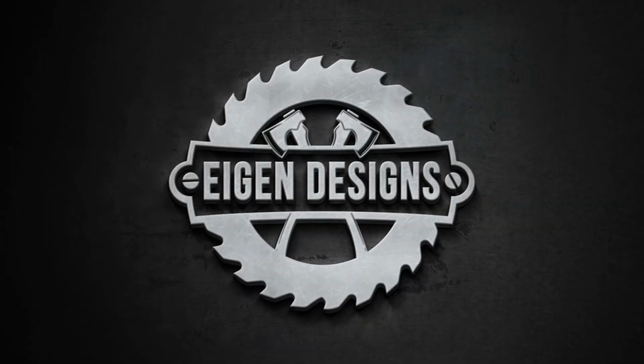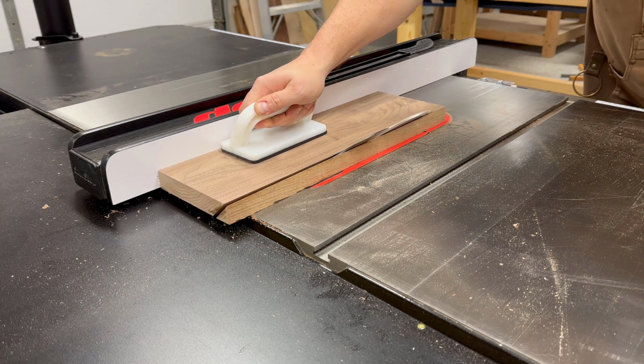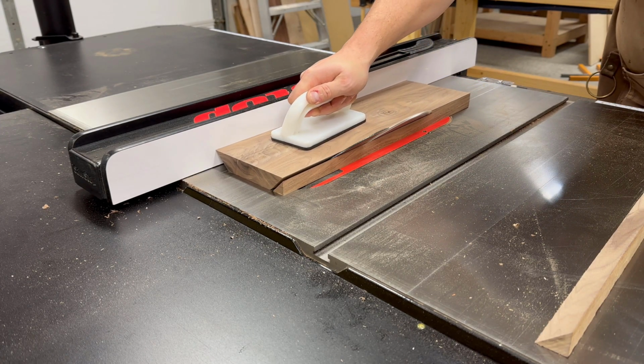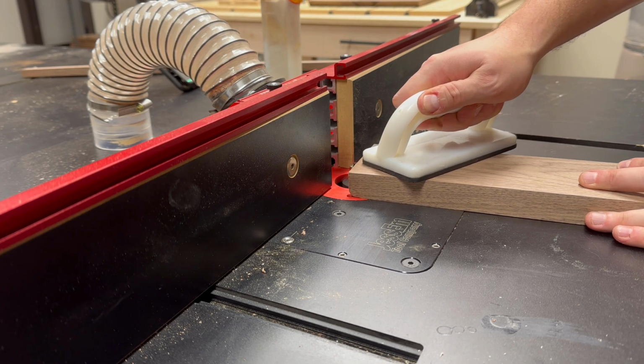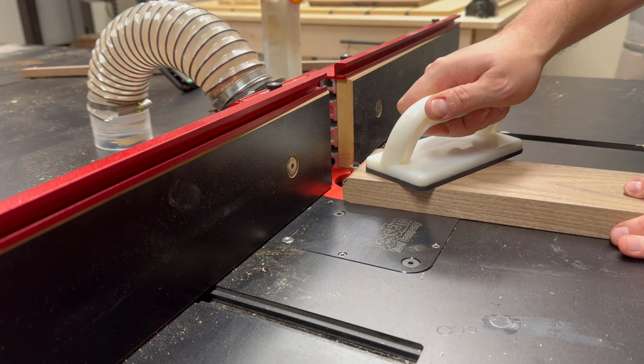While waiting for the inlays to dry, I start to make the other components that are going to form the box for Andy's desk. I put a 45-degree mitered edge on both side pieces for Andy's desk, and then I used a roundover profile to create a bullnose shape for the center divider that's going to be used as a central support.